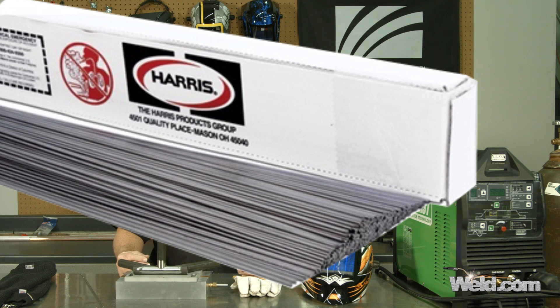Unfortunately, what's happened in industry is we do a lot of maintenance welding. There are filler materials out there that are good for maintenance, good for putting different materials together. If you're looking to put 4130 to steel, or 4130 to any other kind of stainless steel, you can do that, but it takes a certain alloy. There's one alloy that's been out there for a long, long time and it's called Super Missile Weld. That particular filler material has a high chromium content in it. The average welder wouldn't know that — he just knows it by the name Super Missile Weld.